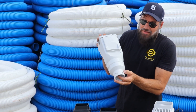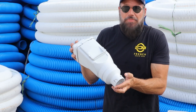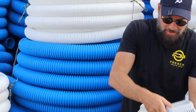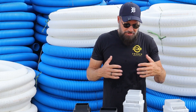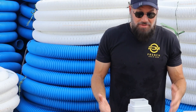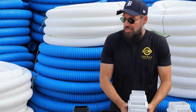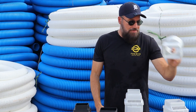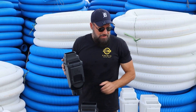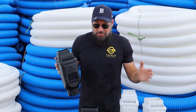We sell it so that it snaps onto 3-inch corrugated pipe or goes inside Schedule 40 or SDR 35 — either thin wall or thick wall PVC — they fit just fine. Here's the 4-inch right here; you can see how nicely it slips into the 4-inch PVC. If you don't want the leaf filter part because you think your customer won't clean it and the water will just vent at the vent, then take the leaf filter out. These PVC gutter adapters get brittle and turn yellow, and the water sprays out during really hard rains. We offer this in two colors: piano black and a special white that matches aluminum downspout white — two fantastic colors to choose from.